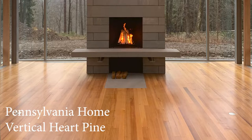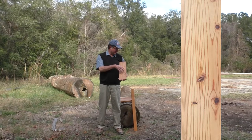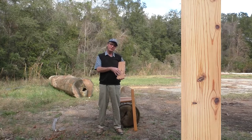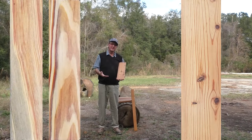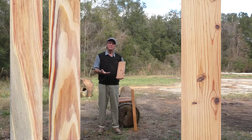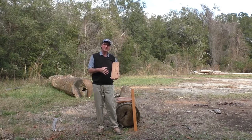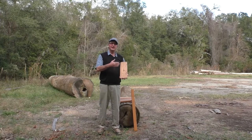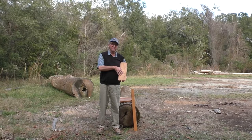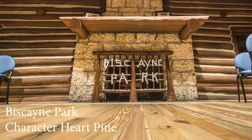This next piece of wood is what we refer to as a character grade. In this particular piece you can see it's a character piece because it has larger and more frequent knots. Some of the other attributes of the character grade are more variation in color, maybe some ancient bug holes, and there may be more sapwood to heartwood. Character essentially is the off-fall from sawing select and vertical — if a piece doesn't fall into either select or vertical, it falls into the character grade. Character is terrific for more rustic and relaxed flooring.